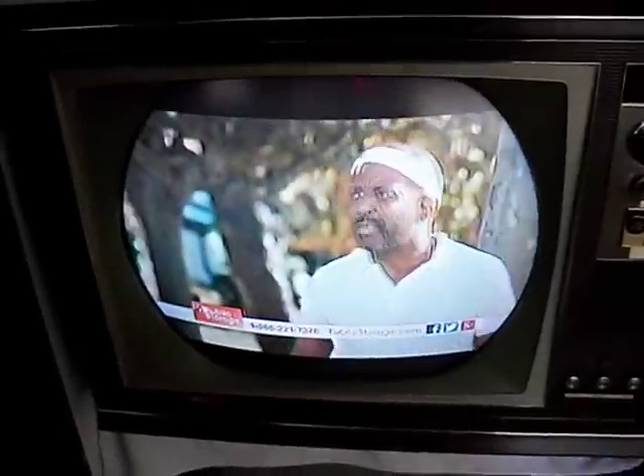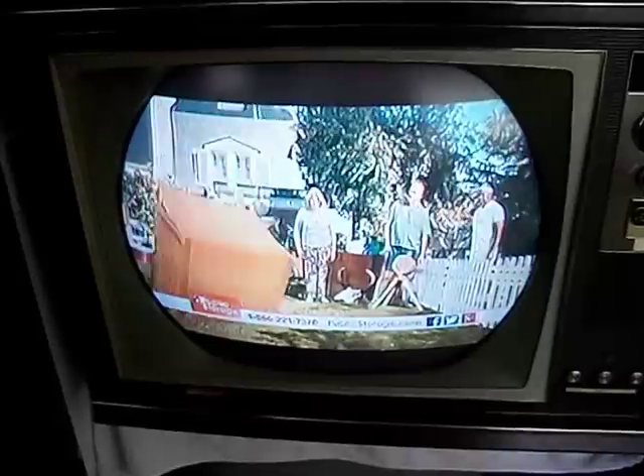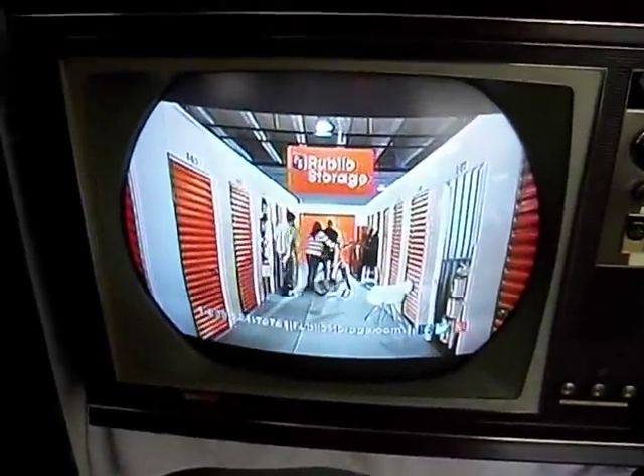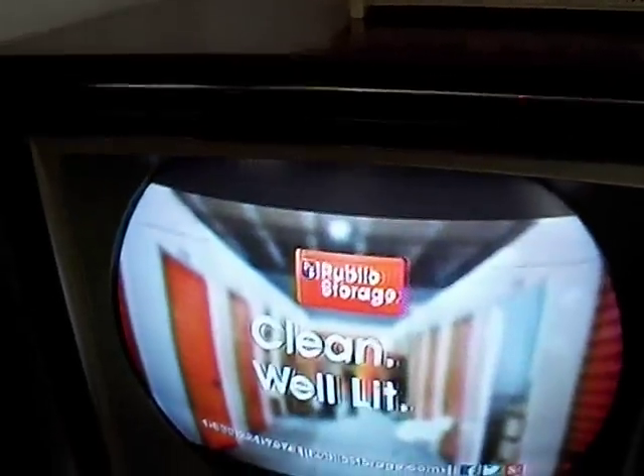Each one will be different depending on the quality of the CRT. This CRT tests okay once it warms up, but when it's first started, the emissions are pretty low. So what that tells me is it's a CRT that's got some time on it — still produces a good picture, but not perfect.